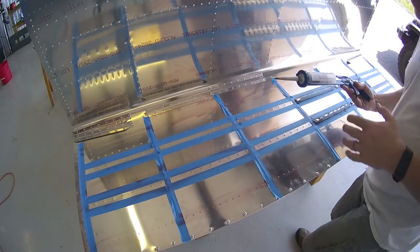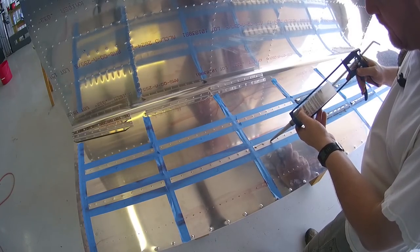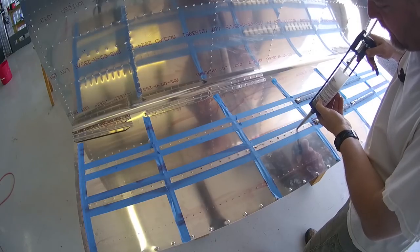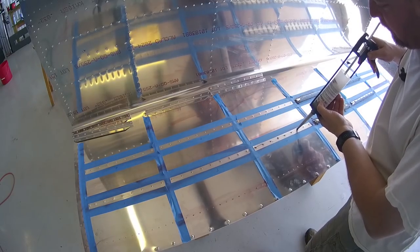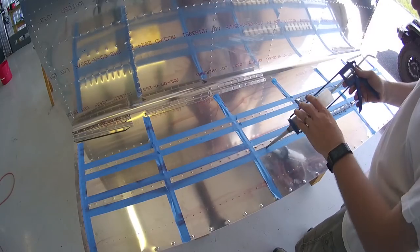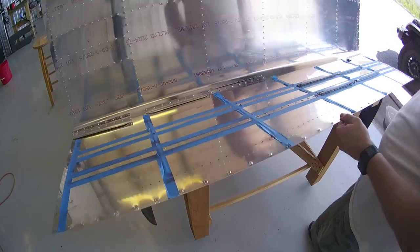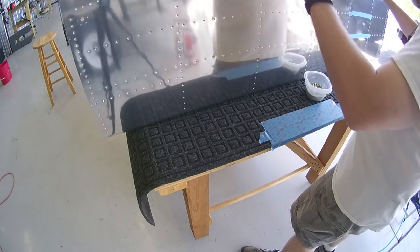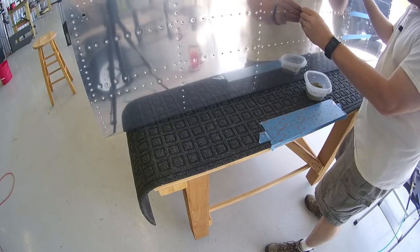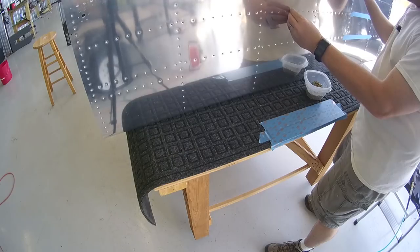Here's an example of the new caulk-gun goop delivery method. What I've been doing is putting a little bit over each hole, like so — this is the wet method, just enough to fill the hole. Once each hole has some goop, every once in a while release the pressure, otherwise it'll sit there and continue to dispense. Then put the baffle in place and put in the rivets — you'll see that the goop is poking through the hole ever so slightly, which is exactly what we want. We want a little bit of goop to come out. This is the wet rivet technique.